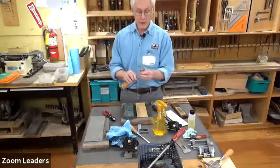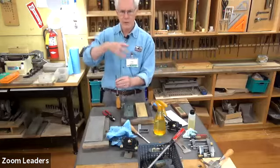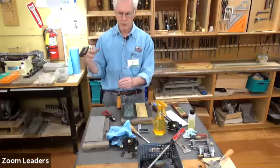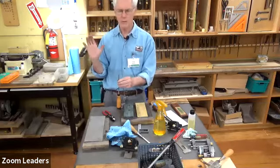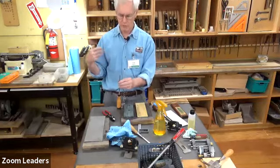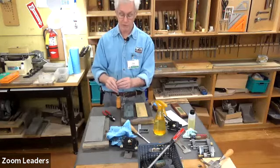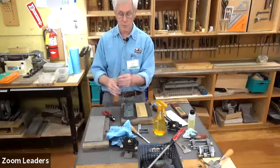When you do that, you get a rounded bevel, and turners like a very soft bevel. They use an 8-inch wheel. People who want to just grind stuff and get rid of it quickly tend to prefer a 6-inch wheel because it gives you something you can feel very well. It's a sharper curve in a way.